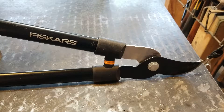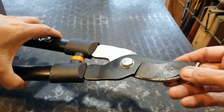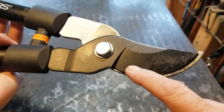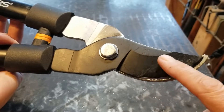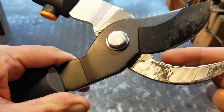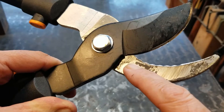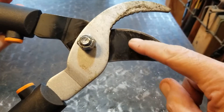One thing I noticed is I'm going to polish this surface up right here. Do you see that tree pitch where it's hanging up? That goes right through the wood and creates some drag when I'm cutting. The paint is going to get removed, this surface is going to get beveled up a little bit more and cleaned up. I noticed the cutting edge came with a little bit of a feather on it — you can see how it's a little jagged — I'm going to touch that up. These surfaces here, you can see how it's not even; I'm going to plane that out and get it all even and polished up.